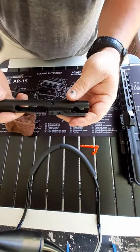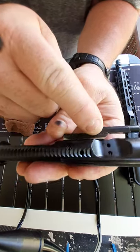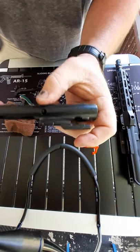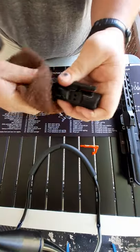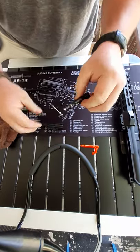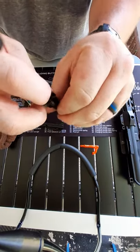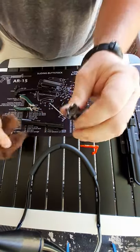You also want to look for wear after you've shot a few times. Look around your bolt carrier group — right here you can see the sheen and coating coming off. Look for your rails — there's a lot of wear. These are the spots you actually want to put a little extra oil. Clean really well right here because there's going to be a lot of buildup in these small cracks and areas.